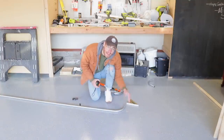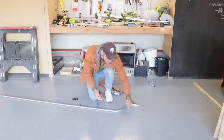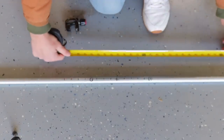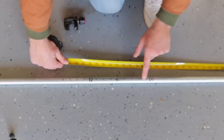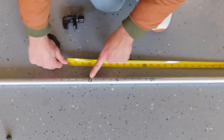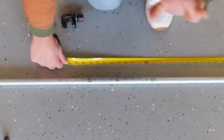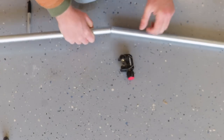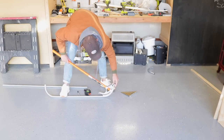What I found by making these marks is that my bend starts nine inches from the edge of the conduit, but the radius of the bend adds five inches beyond that in length. So I measured 40 inches from the end of the bend, subtracted five inches, and that's where the bend should start — because over the length of nine inches, five more inches will be added, bringing us back to 40. I have PDF plans on my website linked in the description that go into this in further detail.